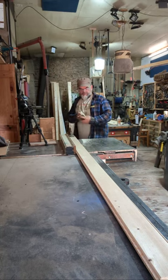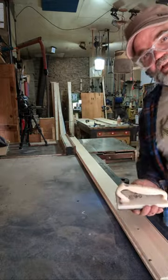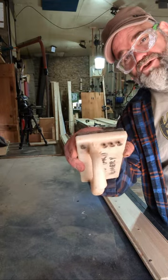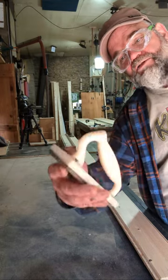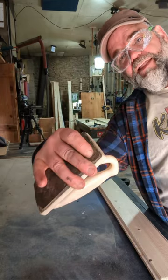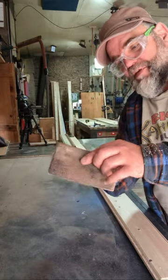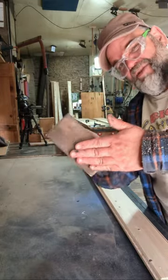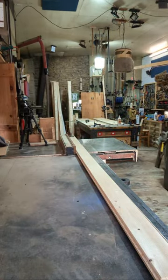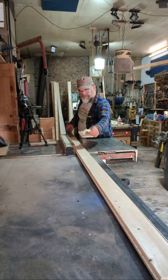And I've put little screws in there, I don't know if I showed you before. Don't leave it like that on the saw, obviously, it'll get kicked back. But these little plasterboard screws, bugle head screws, drywall screws, are pointing just through the foam. The problem with these things is the foam is slippery after a while, it's dry, and it's not very grippy. I can use that as a way of holding it to the fence.